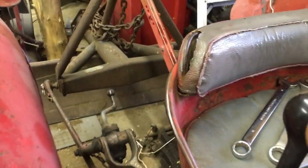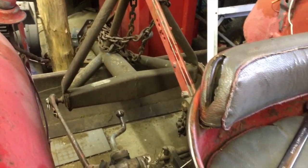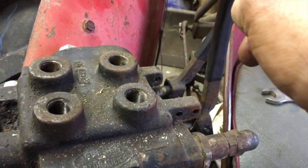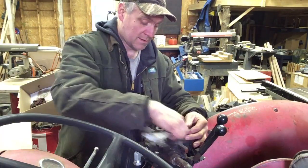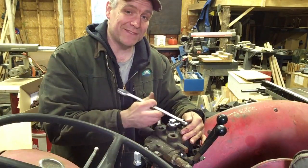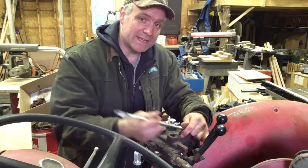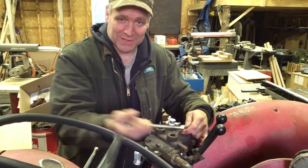I am going to plug off these two lines because this one has a float position, which means it'll follow the ground. Normally this would go to your boom lift, but since my three-point hitch loader will not have a boom lift because it's three-point hitch lifting it, I'm going to put it to the bucket. So I'm going to plug these off so I don't get a face full of oil. On these valves there's a built-in relief valve, and there's a relief valve in the tractor, so even if it deadheads it's gonna have lots of chance to blow off the relief valve.